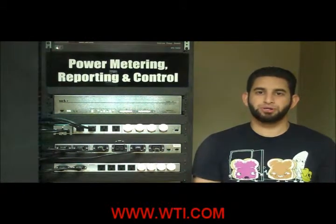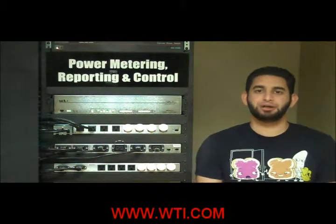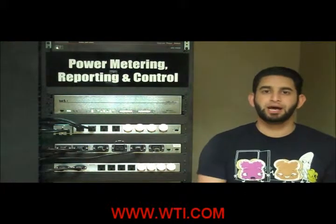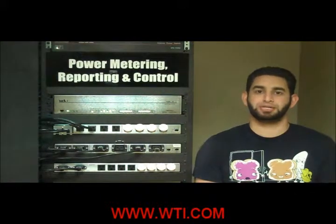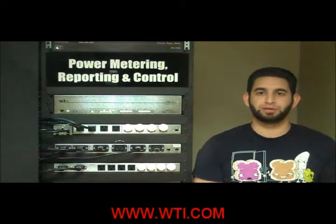If you wanted to go with a unit that you wanted to use all around the world, you'd want to standardize it on an IEC outlet because it can be under-voltage rated. So it means it can run from 90 to 240 volts, giving you the flexibility to run at 110, 120, 208, or 240 volts. Your standard NEMA outlet gets maxed out at 125 volts, so it's only good here or anywhere in the world that will run anywhere from 90 to about 125 volts.